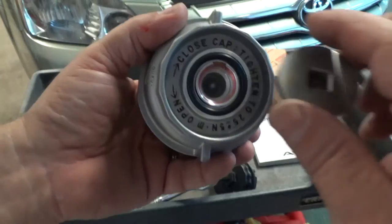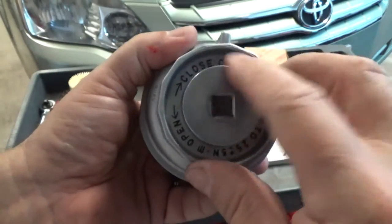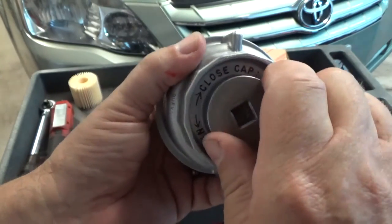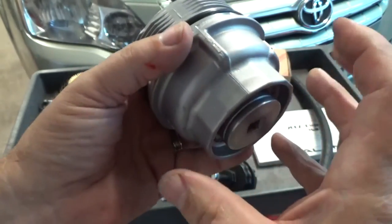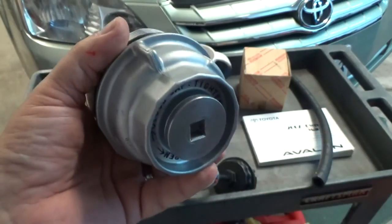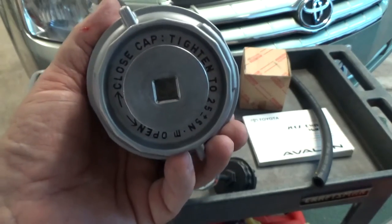Now for the bottom — your O-ring goes right in here. It should fit in there and stay. Notice how it's just slightly bigger than the area it fits into, so it's actually holding itself in place when you assemble it. Then we put our bolt back in. Don't forget this cap is aluminum — when it expands it is super tight.